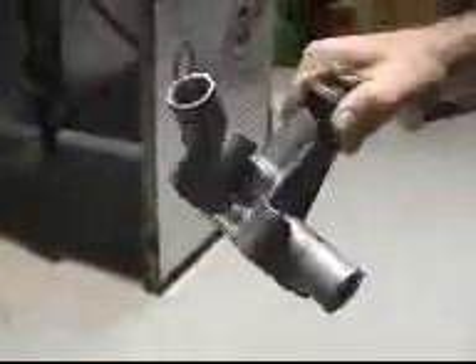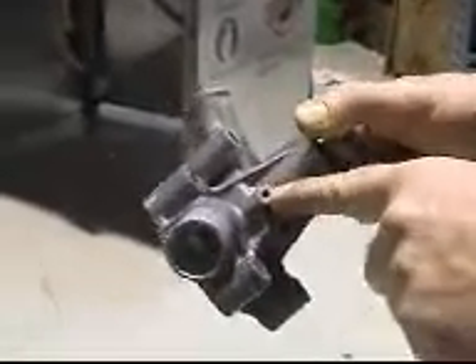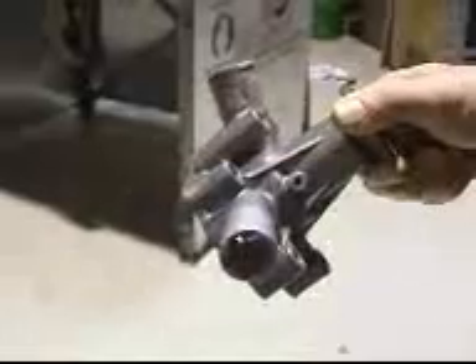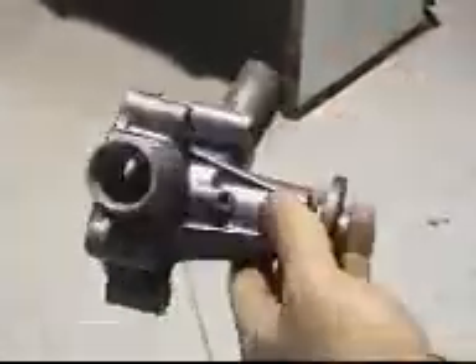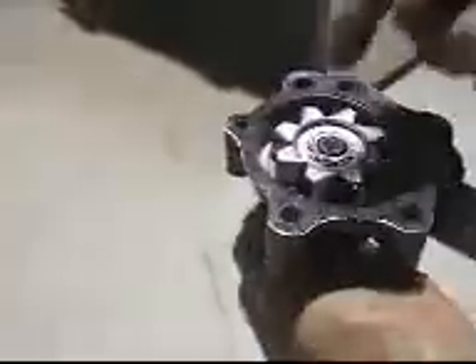This centrifugal pump can run without water — it won't be hurt by that. But the impeller pump is a displacement type and really needs water. Sometimes you'll get a premature failure — the telltale sign is red coolant coming out of there. If you see that, the pump needs replacing. The bearings inside are sealed, so you can't service them — you replace the whole unit.